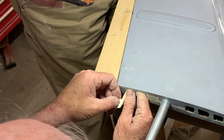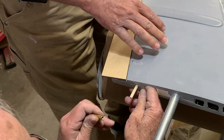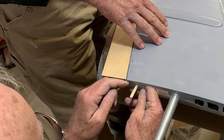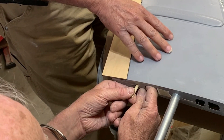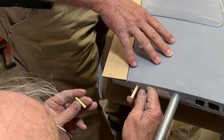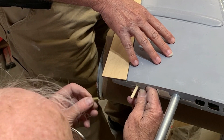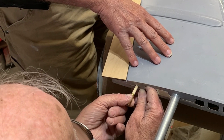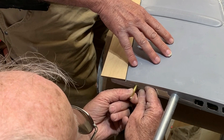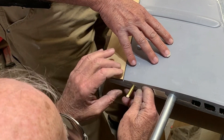We're going to peel this tape off. So this sleeve — because we drilled it with the brass tubing — it's going to be lots of room for this thing to move. So what we've done is made this sleeve. The chopped-up end should be the outside, and this will center it. I'm going to push it just a bit in, there we go. Get the CA and the kicker.